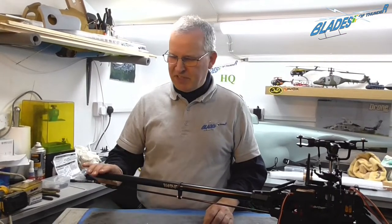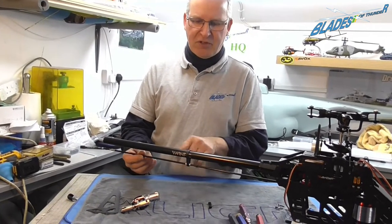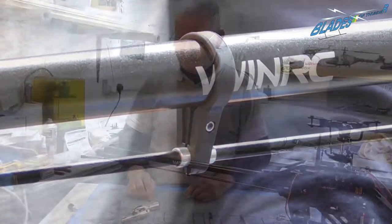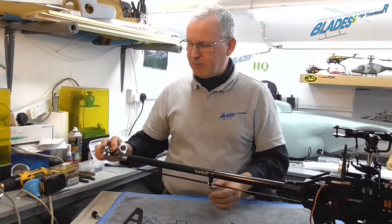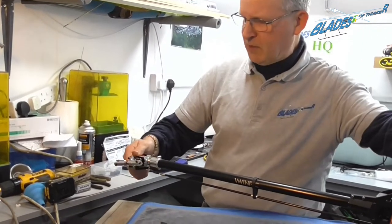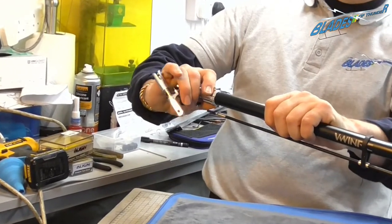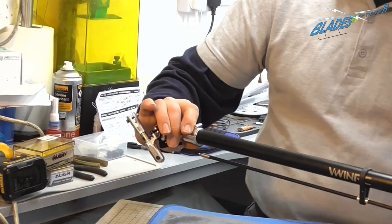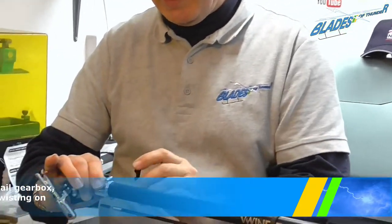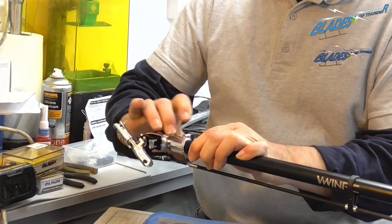Okay, right, now we'll put the tail on the boom. As you see, we've mounted the tail control rod and secured the sleeve in the centre to give the tail control rod a little bit of support. And we'll fit the fully assembled tail gearbox assembly. Now, give it a quick wriggle to make sure that you've got the gear in the right place and that you have the locating holes lined up for the peg on this little mounting bracket. A little bit of a wriggle, goes in with a nice click,